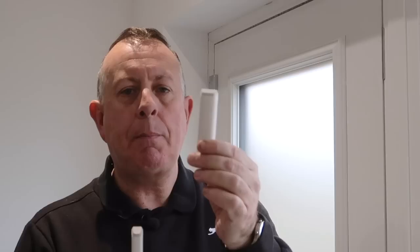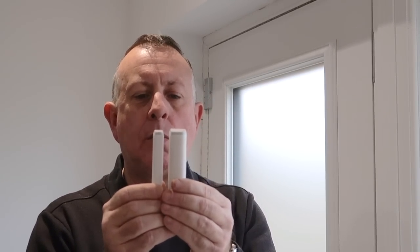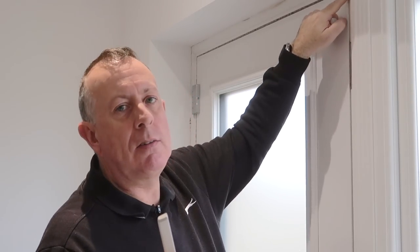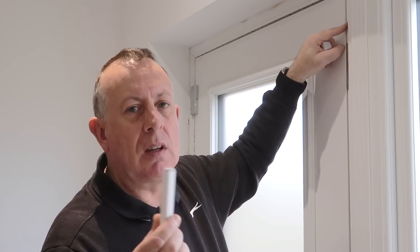That's all the motion sensors fixed — you didn't see the other two because they're in secret locations. Once you've done one, each one only takes about a minute; it's very straightforward. Now for something a little more challenging: the door contact sensor. The big part with the battery has to sit within 25mm of the small sensor part when closed. On my door there isn't enough room on the frame, so I'm putting the big part on the door, and I'll need to notch out with my multi-tool to fit the small part around the architrave.